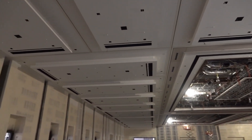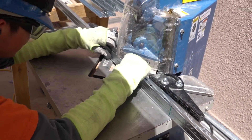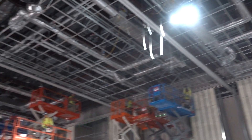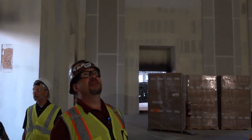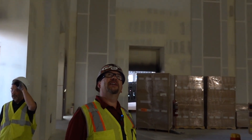All the light coves in this ballroom are framed pre-jigged off-site and being installed on different centers — a combination of four and six-foot centers — to work with all the MEPs, the lights and the diffusers. And these look really good, all finished.